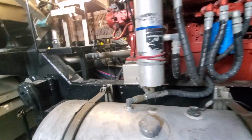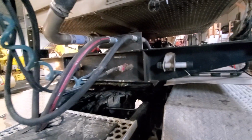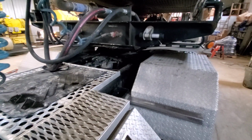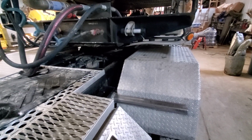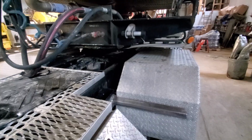Also, when you crank this PTO up, this is a hydraulic driven starter. So that's how you're gonna start this thing. Hydraulics coming from the PTO of the tractor. Underneath there, there's a switch inside. Kick the PTO in. Some of them are clutch in to stop the transmission from spinning, and then you turn the PTO button on. Some of them, like the automatics, you can just turn the PTO button on and then idle it up. Idle up to about 1500, and then you can start this up.